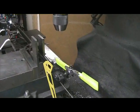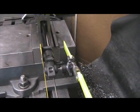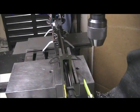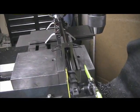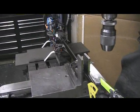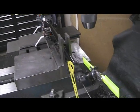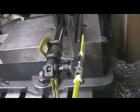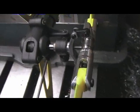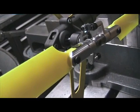We can see that the tail rod forces were indeed the highest I've ever seen on this size helicopter — at over 40 ounces. On this helicopter I have a 5083MG high-tech tail servo. It only has 21 inch-ounces of torque max at 4.8 volts, so if I had my ball at a half inch from the center of the servo wheel, it would use every bit of the max torque to get to those two extremes. So now we're going to make some new Chinese bolt and nut combination to replace the stock blade bolt in the Align metal grips and we'll see what happens.